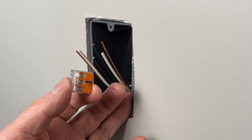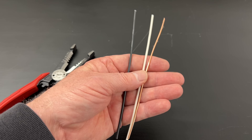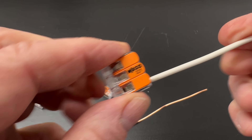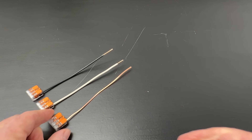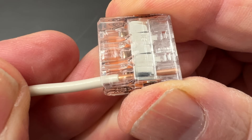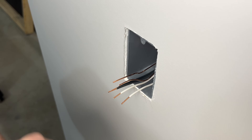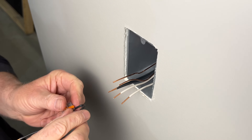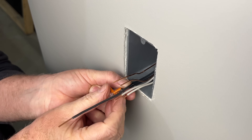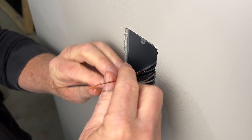With two sets of wires, we're going to need one with three connections — two for our wires in the box and one for our pigtails to our receptacle. We'll connect our tails first. Strip about half an inch of insulation off our wires, insert them into the connector, and snap the lever closed. With the WAGO 221, you can see that the wire is inserted all the way to the end of the connector and that there's no insulation showing. We'll also make 180-degree bends on our tails to make them easy to connect to the short wires inside our box. We'll insert our wires and snap the levers closed, then hook up our other two conductors as well. These are very easy to use.